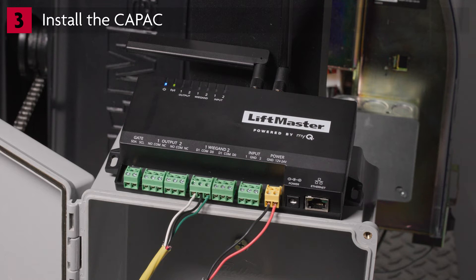You may consider moving the unit or adding an external cellular antenna extension kit. Should you experience an amber or red color radio LED on a Wi-Fi network, work with the site's IT to determine the cause and resolve the connectivity issues. Connectivity issues experienced on a cellular connection will need to be troubleshot with LiftMaster's technical support team.